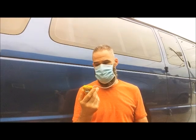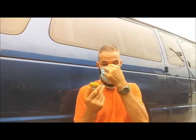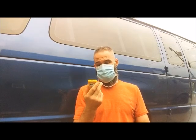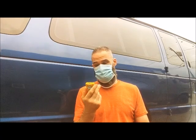I'm just going to breathe a little bit here into this mask and we'll see what we get. I'm trying different things — deep breaths, breathing through my nose, short shallow breaths. It's going to come back up to 20.9% in a minute and stop alarming. This will start alarming at 19.5%, which OSHA states is an immediate threat to life and health.